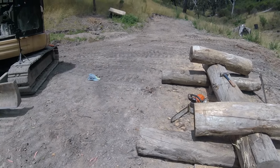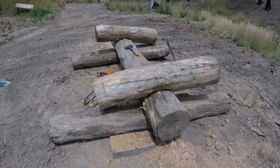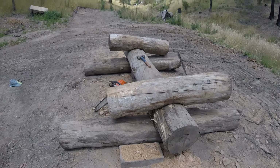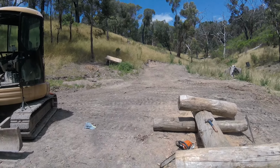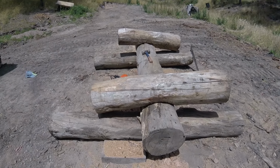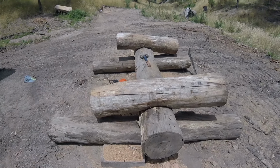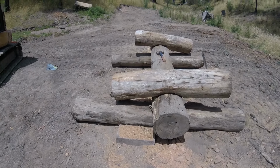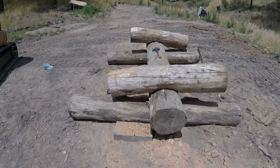Both sides there will be two seats, and then, like I say, I'll bring some steel dowels, some rebar. We'll drill some holes in each of these pieces of timber and get them doweled in place, but we'll only do that once I've got it actually in situ over there. Any mismatches we've got, I'll be doweling these in place and they'll be fixed. So hopefully it won't really matter that much. The slight gaps and the fact that it's not a really tight joint shouldn't matter at all.